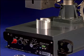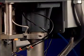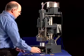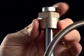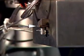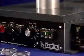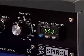Other standard design features include a precision Blanchard ground machine base plate for easy fixture mounting, simple up-down adjustment of the machine on a heavy-duty post-mount frame, a retractable orientation head mounted on linear recirculating ball bearings, fine adjustment of depth of insertion, and a quick-clear insert orientation head — all inserts in the installation circuit can be removed without the use of tools. Also included is a Spiral-made tooled stainless steel vibratory feed system and solid state electronic controls with a 24-volt DC PLC-based operating system.